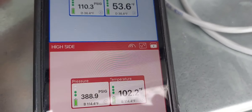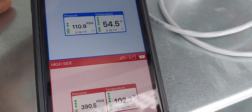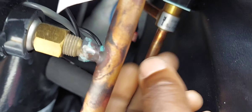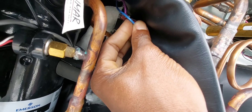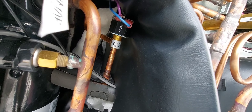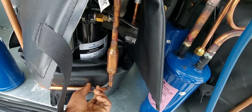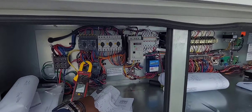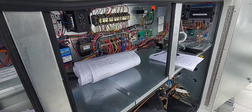The outdoor air temperature and return humidity — I didn't run those wires, but I did run the supply air temperature wires — that's where these numbers come from. It's kind of windy up here. Looking at the cooling number two readings — that's 57 degrees supply air. It's 74 outside and we're getting 57 supply — that's almost 20 degrees of temperature drop. This circuit isn't looking too bad at all. I think I might be good on the charge — I'll see as time goes by.